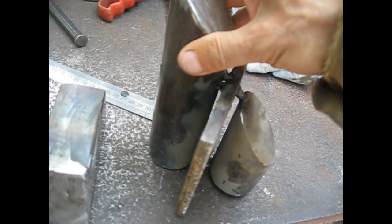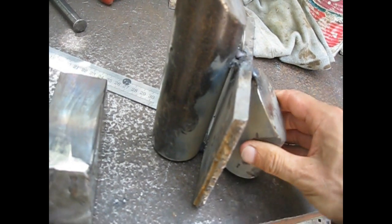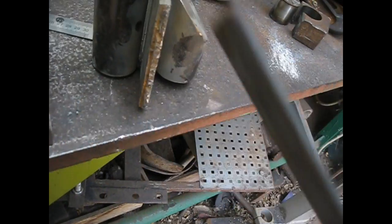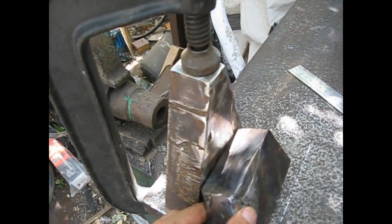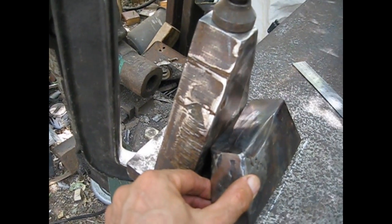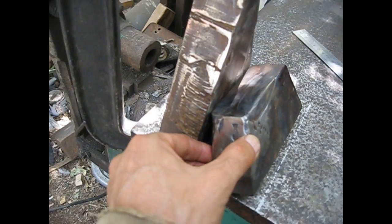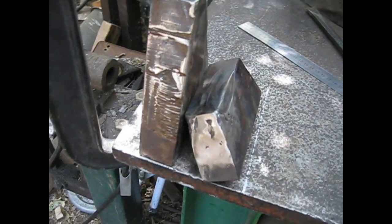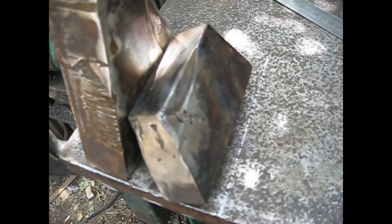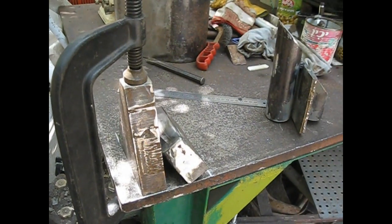This is going to be the structure or skeleton, as you wish, of the rounded horn. I used this bit of flat over here to leave a 4 millimeter space to allow me the full penetration welding, and here is the setup to start making the skeleton for the angled horn, or tail, or whatever you want to call it. Okay, it is going to be something like this, and I already filled up here this gap that was lacking material. Okay, let's start the welding.